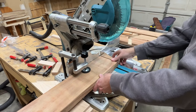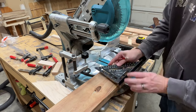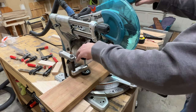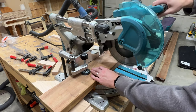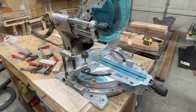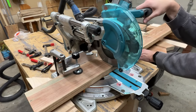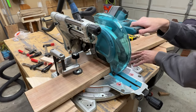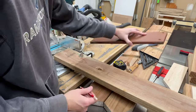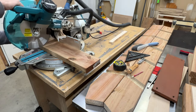With the sides done, I'll move on to cutting the stair treads. I can get one tread out of each of the offcuts from the sides. The remaining parts I'll get from another board — I cut the knotty section off at the end and then cut the remaining parts. This piece I'm cutting now will go behind the top step. I think this is just to help make sure the kids' feet are firmly on that first step before climbing down.